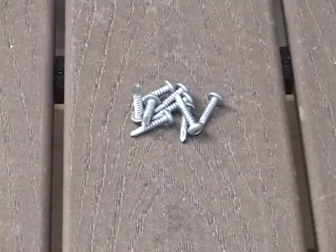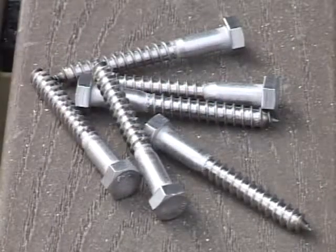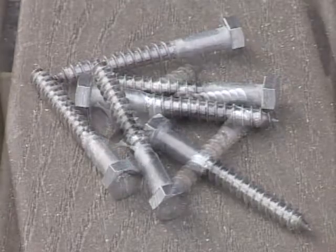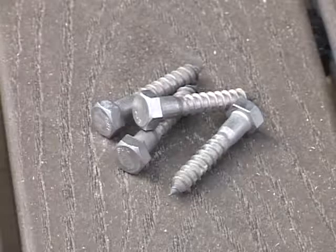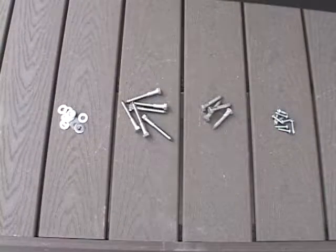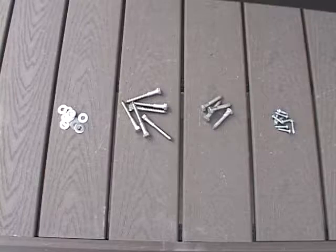Number 10 1-inch stainless steel tech screws to connect the posts and sleeves to the railing as shown, and stainless steel anchors, bolts, or lags to attach the posts to the deck surface. We'll be using stainless steel lag bolts to attach the railing structure on our instructional deck. Check with your design professional for the correct hardware mounting requirement to attach your railing system to the decking substrate or structure for your application.